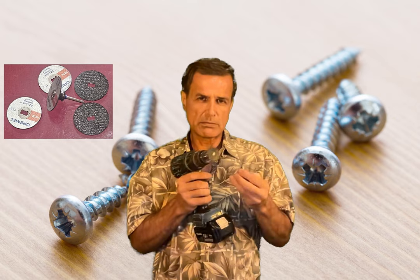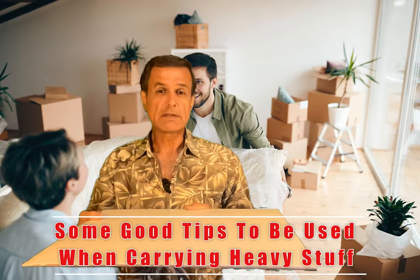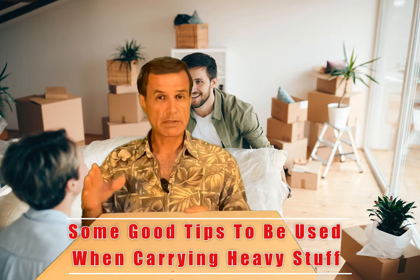Wait 10 minutes and try again. If it's a big bolt or screw, you can make a hole in the head of the bolt and try that as well. If there's a bolt with a nut at the other end that you want to put back, make a hole in the head of the bolt and use a pin punch with a hammer. Hold the nut at the other end with a wrench and spin it so it will come out.